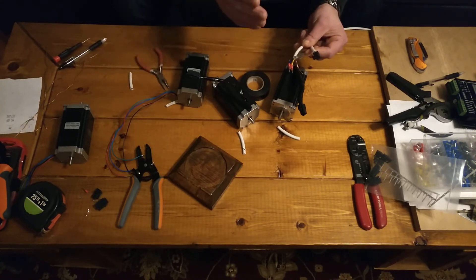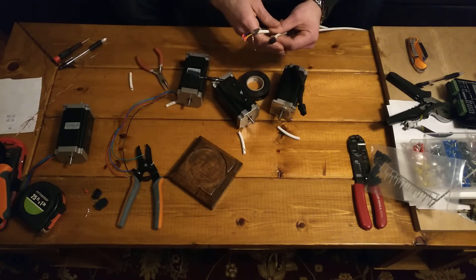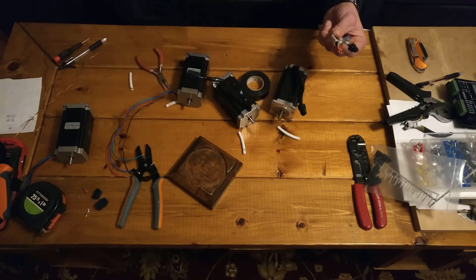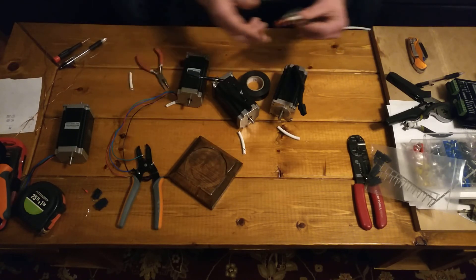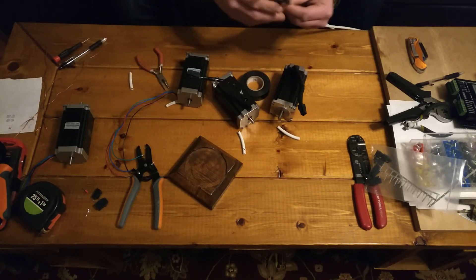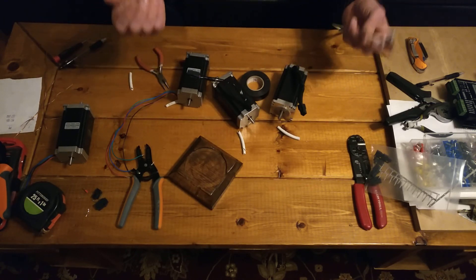So just think about it when you're doing your wiring and know that's a thing to avoid. If you're having any strange issues, take a second look at your wiring and make sure you didn't accidentally create multiple paths through ground. The way you usually solve this is by having only a single point where everything is grounded — either near your control cabinet — all your grounds go to one spot, and that way you can't have a loop. Anyway, I think that's all for now, so I'm going to get back to wiring this stuff up and actually getting the machine running.